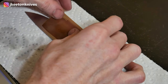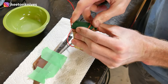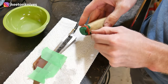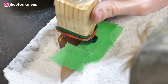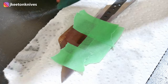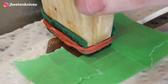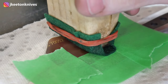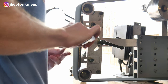Next we're going to stencil on my Maker's Mark. I'm using a DIY etching machine that I built — this thing works great. I'm going to be doing a DC etch since I'll be stone washing this blade — there's no need for AC. The AC kind of gives you darkness and the DC gives you depth. I normally hit it for about 12 times with one-second holds, and that gives me a nice deep etch — it will catch your fingernail, almost like somebody stamped your blade. After we get it etched DC, we take off the stencil, spray it with a little Windex, and hit it on the Scotch-Brite belt again to clean up that etch.